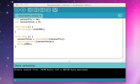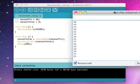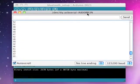So if we actually download this to our boards and take a reading, I'll move the terminal into what you're actually seeing here. So here we're seeing values coming in from the actual sensor, which is a Sharp proximity sensor. And I'm going to move my hand in front, and as you can see, as I move my hand in front, the values get larger. Move my hand away, the values get smaller. So you can see the granularity there as I move my hand up and down against the proximity sensor.